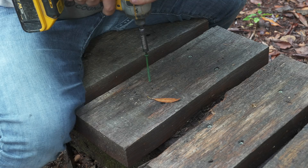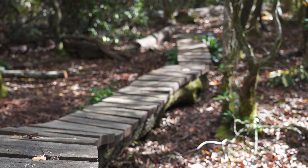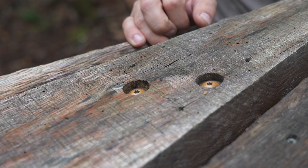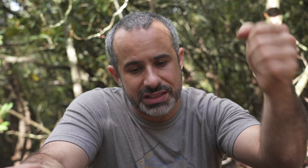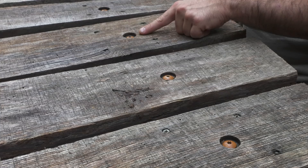Keep working our way down. We're going to have to do a good job of keeping the spaces between these a little more clear, and I think we can get another few years out of it easily. Here at the end of the Elmer Fudd skinny, the timber gets really narrow and I have to do this turn, so these are cantilevering off the side really far. I knew that could present a problem, so I used timber locks in them — and they are just super strong. They haven't loosened up the slightest bit, even with bikes slamming on the end. In the future I may actually use timber locks to hold down planks more often — one timber lock as opposed to like six screws.